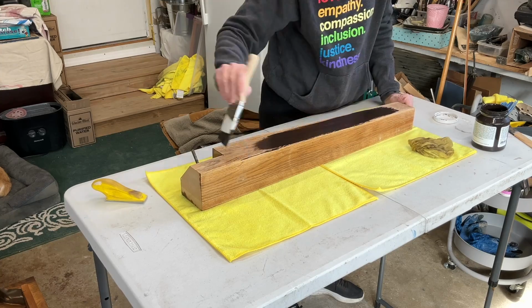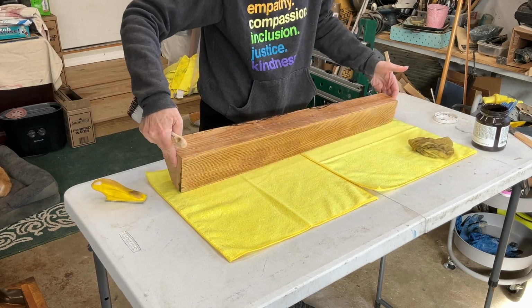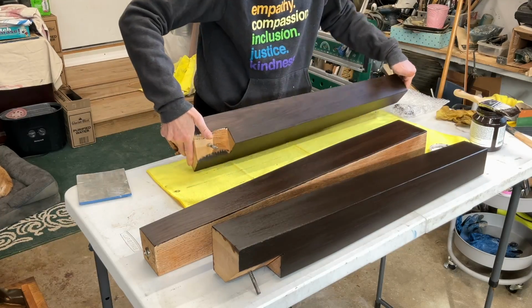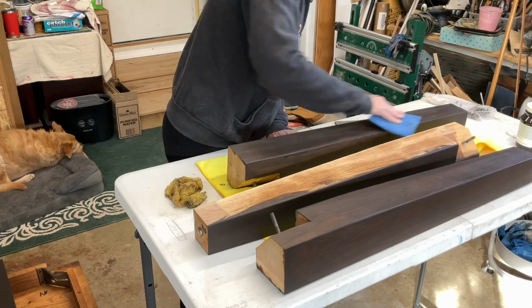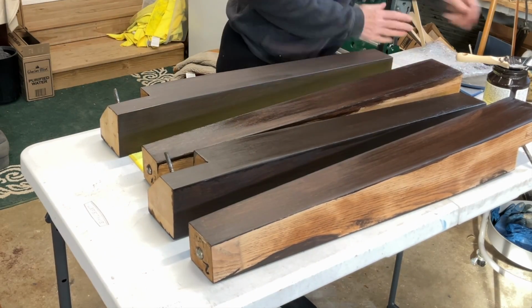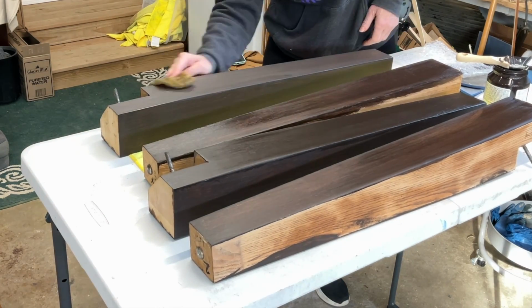with 400 grit. I'm using a chocolate brown again, and after the first coat I used that finishing pad in between coats. And I think I put on 3 coats and came back and touched up here and there. And after everything I do, I always use the finishing pads because it just makes it so nice and smooth.